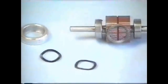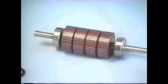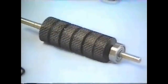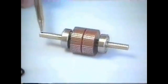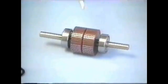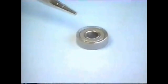This is a single-stack 23 frame rotor. This is a two-stack version with two magnetic stacks, and this is a three-stack. The difference in color is due to a different epoxy used by the vendor in assembly. Looking at the single stack, we have a stainless steel shaft, two bearings, and a magnetic stack. Motor life is mostly dependent upon the bearings, which are the only moving part of the motor and the only part subject to wear from the load.